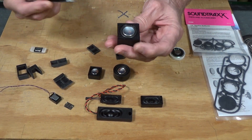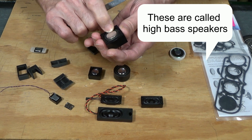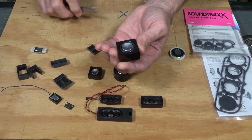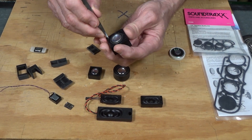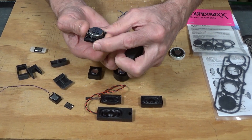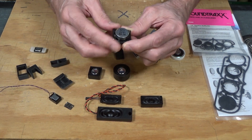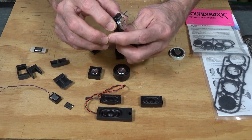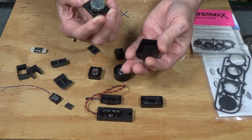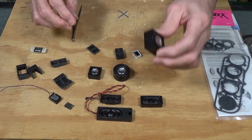These here are a neat design — I got most of these from Railmaster Hobbies. They have a rubber-like diaphragm and then a metal, I think aluminum, cone in the center. They're designed specifically, like the other bass reflex speakers, to enhance the bass volume and output. This particular one is a 28mm QSI speaker rated at 8 ohms and 2 watts. I'll get into wattage importance in the next video. There are contacts for soldering the wires on either side, and these can be installed either way. They come in various sizes — a 28mm round and one that's about half to three-quarters of an inch.